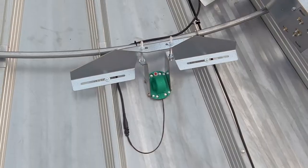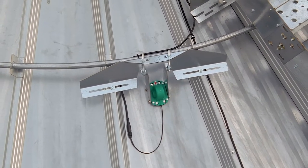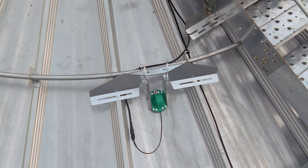We have digital cables that get installed throughout the bin that are going to monitor the temperature and moisture of the stored grain. That information comes up to the hub, which then wirelessly transmits that to our system, and that's all on the top of the bin.